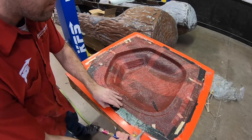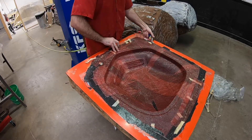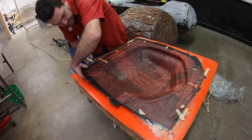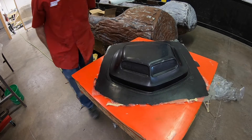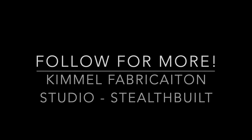Now it's time to remove all the disposable vacuum bagging materials. I blow a little bit of air under the flange edge, which helps separate the piece from the mold. You'll notice the piece has a little bit of polyvinyl alcohol on it which creates a film that looks like saran wrap — it looks like there's something wrong with the part, but it just washes right off. Then we can cut that flange edge off, give it a quick sanding and clear coat, and it's ready to go to the customer. If you enjoyed this video, be sure to click subscribe, give us a like, a follow, and a share — we'll see you on the next one.